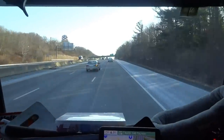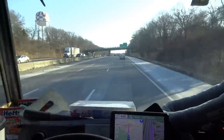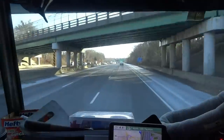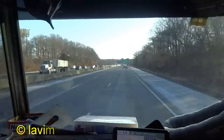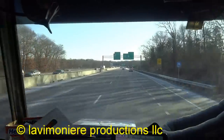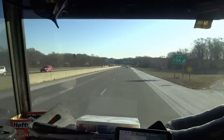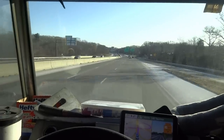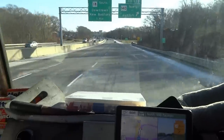Morning guys, December 20th, 2019. This one here, I gotta go change a tankless heater and a boiler. I was there a few weeks ago. I did a burner service for the guy, and I noticed that the electrical line going to the main control was all rotted. I looked up, I thought it was the water pipe dripping, which it was wet, but when I looked into it deeper, the tankless plate looked like it was leaking. So I talked to the guy about it, told me she put a new boiler in there, but he wants to just change the tankless and clean it up. So that's what we're gonna do.